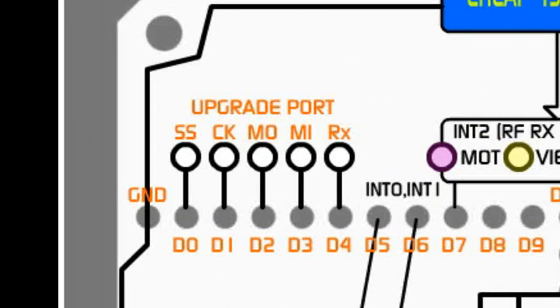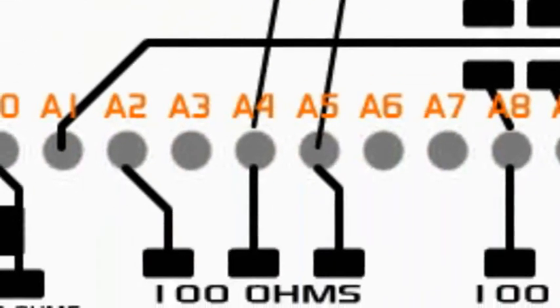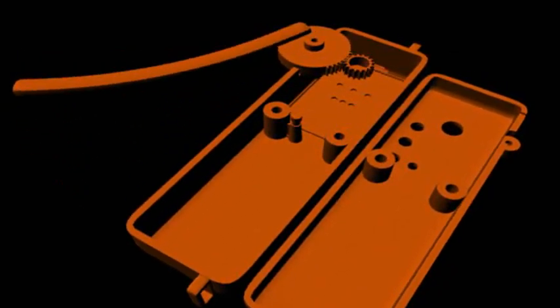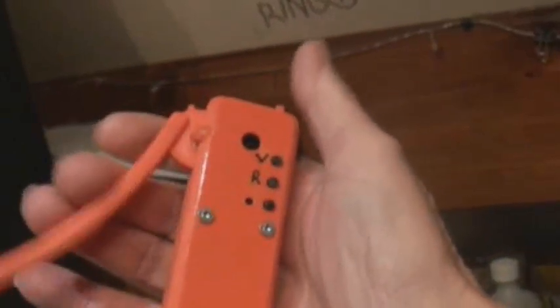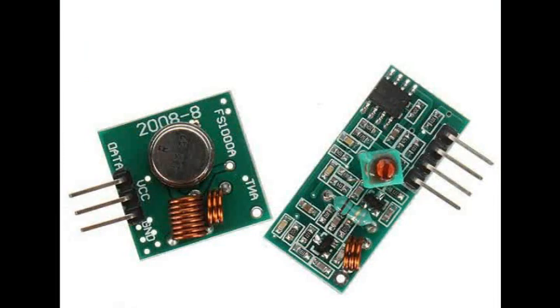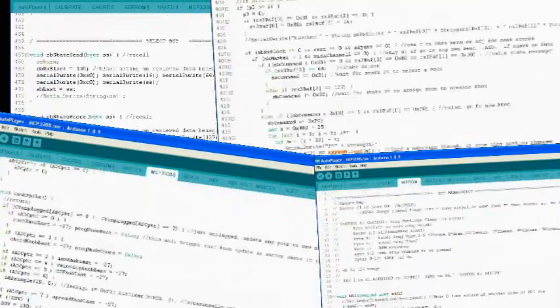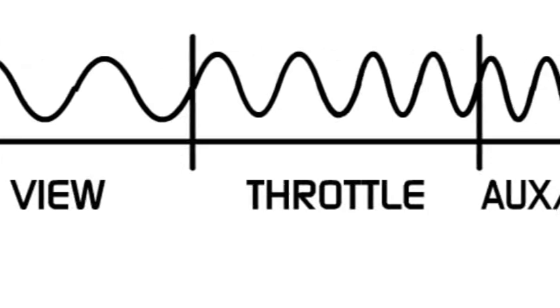I left the SPI bus pins alone just in case the aforementioned force feedback becomes reality. The weight shift inputs are bridged over to a pair of interrupt pins so I can revert to an analog method if need be. The throttle was made to resemble a gas paramotor control. Because there needs to be some buttons to control the simulator when I'm tied up in the harness far from the computer, it's wireless using a pair of dirt cheap Chinese boards that transmit data at 433 megahertz. To take a break from heavy programming, I opted for frequency to data conversion using a simple 555 timer chip. Each part uses a different frequency range and once regulated to 5 volts is pretty stable and reliable.